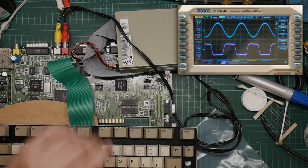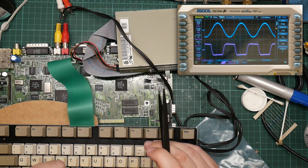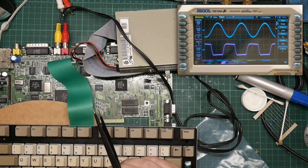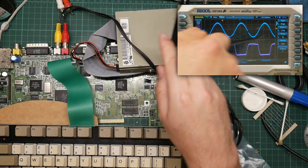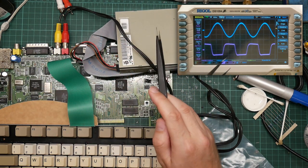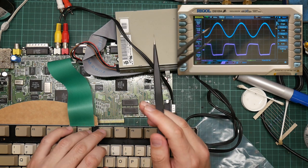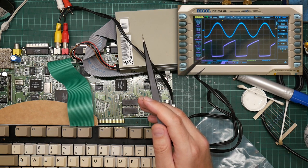Well, that's special. So what you're looking at here is the output hooked up to the oscilloscope. I noticed when I was listening to it through the headphones properly that the volume was not actually that different, but the timbre was very different. So I finally got everything hooked up, and what do you see? A nice sine wave on the white channel, and this, whatever it is, on the red channel. So I think something is terribly wrong with the filtering. What's particularly interesting is if I turn on the Amiga's own filter, I get that, which is also different.